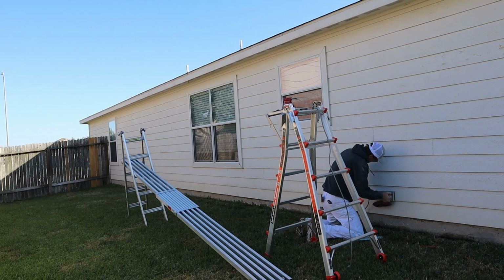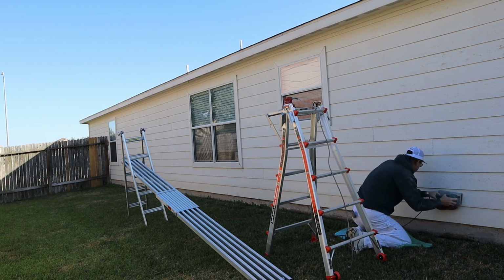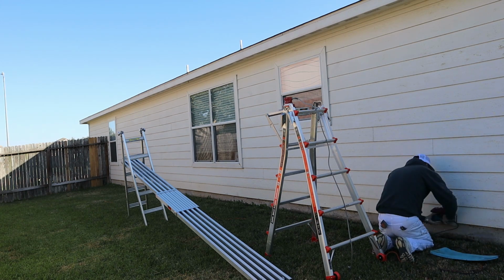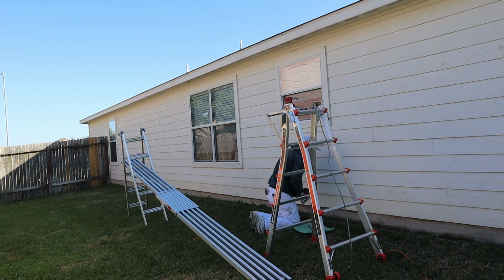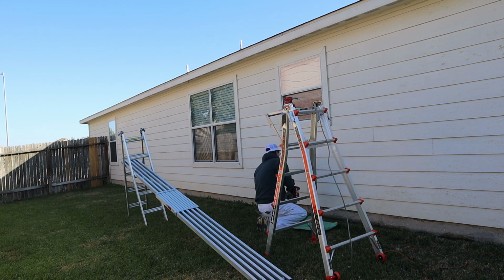I'm not going to try and attach those popped up pieces back down. Instead, I'm just going to caulk under them and around them to hold them there so they won't go any further and water won't get behind them. But I sanded extra there, so when I come to do the caulking, I'll see that there's a lot of sanding marks in one area, and it'll draw my attention to go investigate and fix whatever the problem is there.